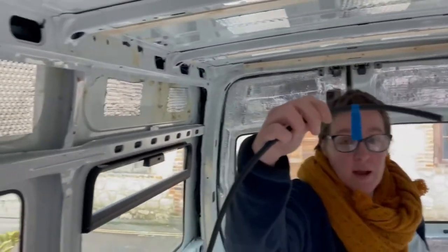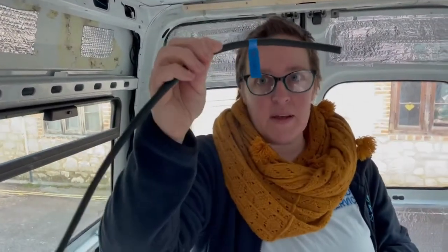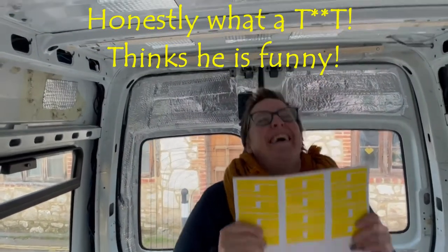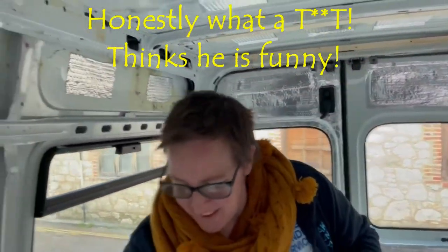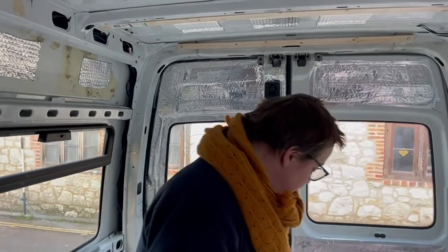It's amazing how fast your bus turns into a spaghetti junction. Buy these cable labels — they are amazing. Do not wire without them, because it's all the same colour. I pulled a couple of cables back through to reroute them and the labels just stay on — they're fantastic. We've put conduit to protect cables where they go in through the metalwork, just to protect them from any movement while the bus is in motion.